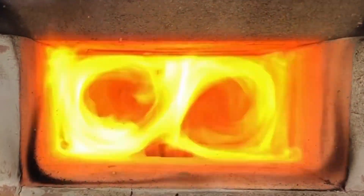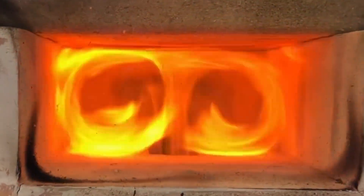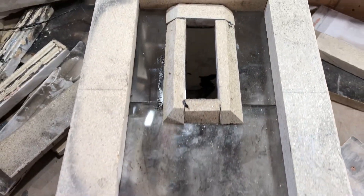Today I decided to try and get more temperature into the secondary air, so I've taken the insulating board out and replaced it with ceramic glass. I cut the pieces to get the exact size to suit the vortex slot, and I also added a few bits of vermiculite to achieve an exact 10 millimeter gap.